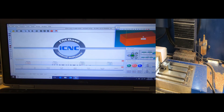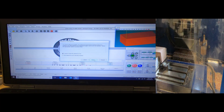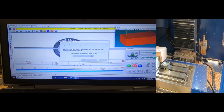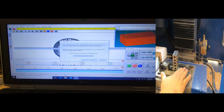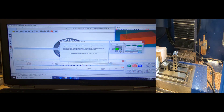In my verify window I'm going to select solid verify so I can see everything. Now I'm going to go to Tools, then Tool Setup Wizard. It says I need to reference height — I'll hit Next, then insert a tool. I'll close my doors and hit Next to insert the reference tool, which is going to be a 3/8 tool. My reference point will be off the top of my 1-2-3 block on the machine table. If I push F5 nothing happens, so the workaround is to hit Stop, hit OK, then hit Next to continue.